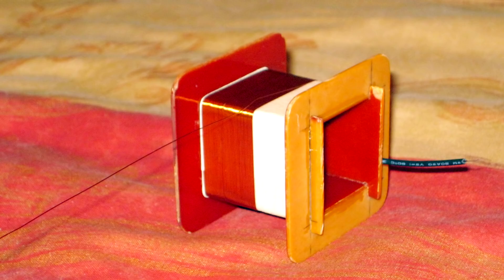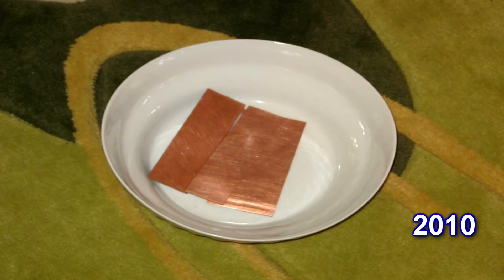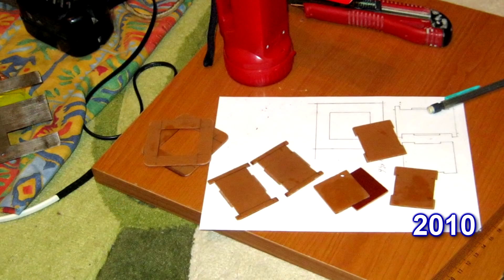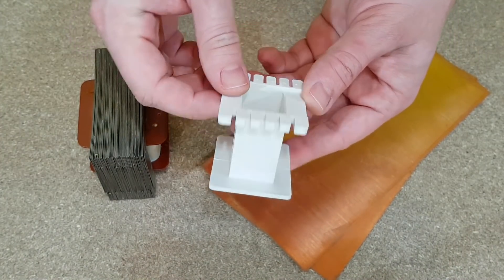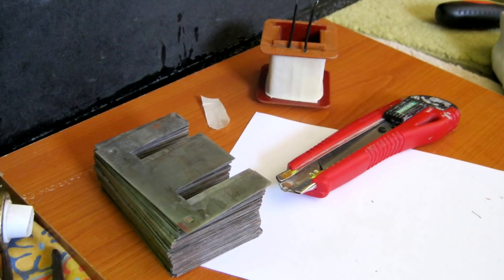Now it's time to show you how I've built one of my transformers. It all started 9 years ago. Back then I didn't have a good camera to record, so I took pictures of everything I've built or repaired. The transformer bobbin is made from a copper clad board — I removed the copper because I need only the base fiberglass sheet. I like this material because it's very strong, non-conductive, and can withstand very high temperatures. But the bobbin can also be made of plastic or cardboard, or you can just buy one. The primary winding is made from a salvaged coil, and the silicon iron sheets are from an old broken transformer, but you can buy these too.